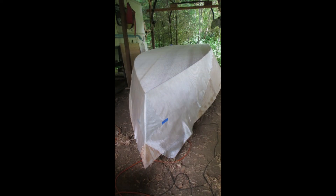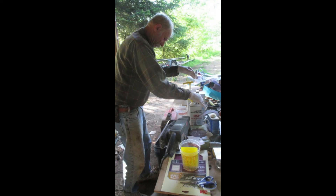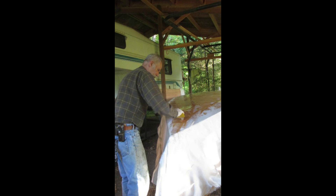I laid the cloth out, smoothed it, and taped it in place. I cut a straight line from the front down the center — a scissor cut following the weave to the point where stem meets bottom — then wrapped each half of the cloth around the bow. I marked the perimeter of the cloth with pencil on the plywood so I could lay it back in the same position. I rolled out the second layer and cut it identically to the first. Starting at the bow, I rolled the second layer back onto its roller and set it aside. I rolled the first layer up on its box, then spread epoxy ahead of the cloth and unrolled it in nearly perfect position, requiring only slight pulls to line up cuts for transom corners and stem.